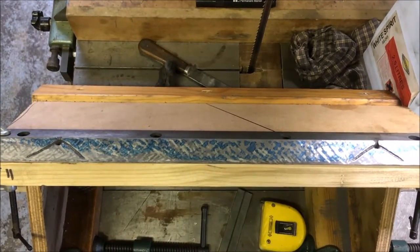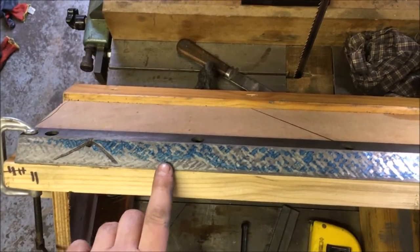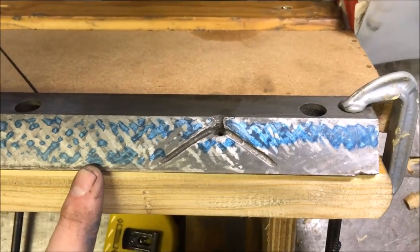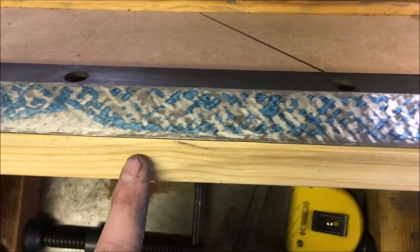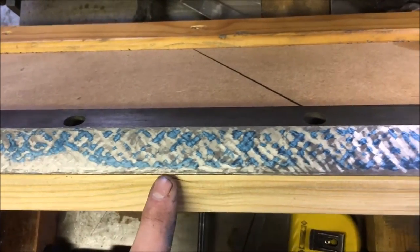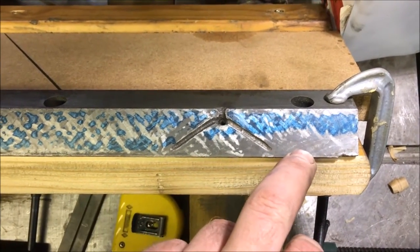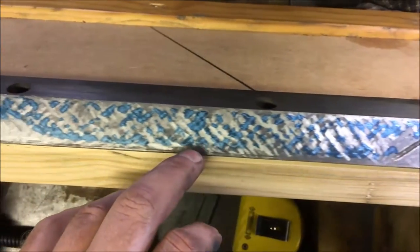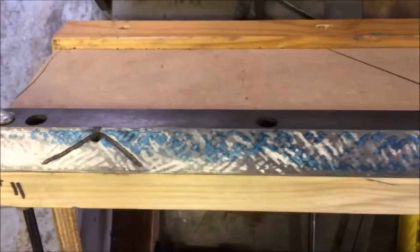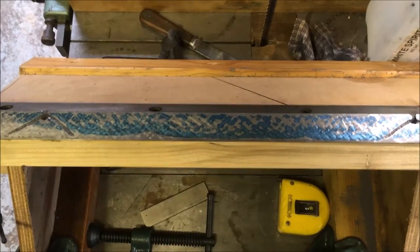This is cycle eight. The rotation points are now about where they should be on both ends. You can tell a bit by the spread of the blue. We're going to shorten down the scrape stroke - I'll have to adjust my allen key on my elbow - and start picking off just the blue. We want to bring that coverage out a bit more, with a bit more density through the middle, a little bit less around the edge. We're getting there.